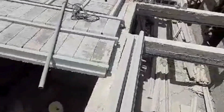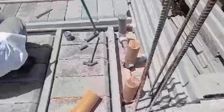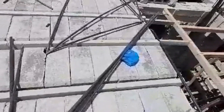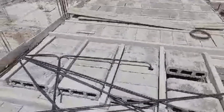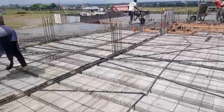One last variation: TBF — T-beams and hollow blocks. This system uses concrete beams shaped like an inverted T with hollow blocks that fit between them. That specific T-shape interacting with the blocks creates a very strong interlocking floor structure — great for load-bearing. Some described it as a potential game-changer for building strong floors efficiently. It's all part of the push in construction for methods that are faster, stronger, greener, and ideally cheaper, and beam and block definitely ticks a lot of those boxes.